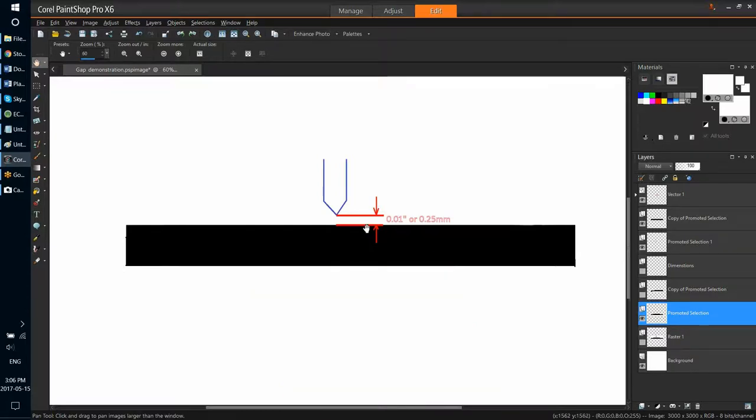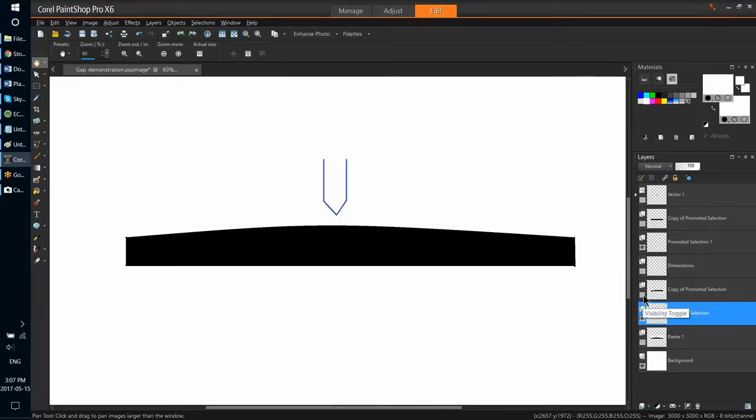So how are we ensuring the stability of the gap, given that the stone surface is never perfectly level or perfectly flat? Well, my diagram shows the stone as kind of flat. In reality, because the polishing machines apply more pressure at the edges, the stone surface looks more like this. Obviously, it's an exaggerated picture, but the stone surface recedes towards the edges of the stone. And moreover, in order for us to simplify the use of the machine, we do not request that you do perfect leveling of the stone.